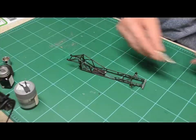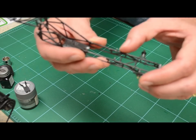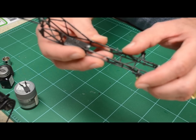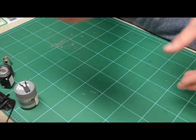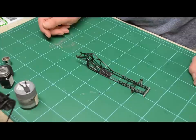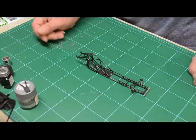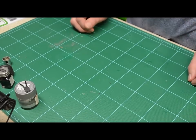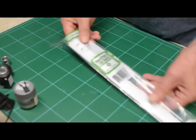I want something that I can drill straight through there and make it nice and clean. What I already have is a couple of globbed-on, glued little studs that I'm going to be mounting some hoses coming up into the engine. I don't really care how that looks because the hose is going to cover that little glob of glue. It just isn't nice for something that's going to be showing, like these fittings are. So what I do is I make a little jig to drill down through there properly.